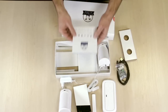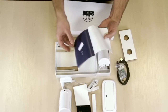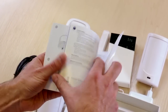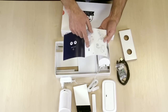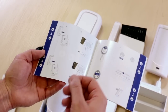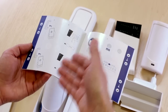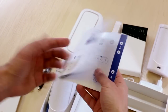The last thing we find here is the quick start and safety guide with a step-by-step visual setup. Once you connect to the mains power, wait for one minute, then call from your phone to the SIM card you've just inserted. You will get back a text message with a PIN code which you use to arm or disarm the system. You can arm and disarm via phone, keypad, optional key fob, or using cloud services — Android, iOS, or web applications.